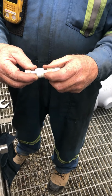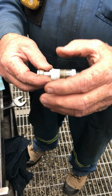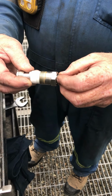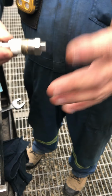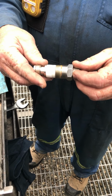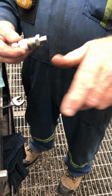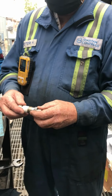All right, for your sealing. The tighter you turn this, the tighter it goes, it stops your leak, and it tightens the shaft. You go too much, you stop the leak, but you can't turn the shaft. There's tweaking involved. You can't overdo it, so the right person on it. Same thing with the packing nuts. You turn it too much, you'll stop the leak, but then you seize the shaft, you can't turn it. So the right person on it, right?